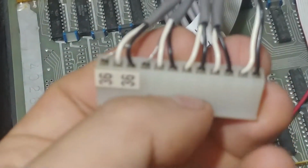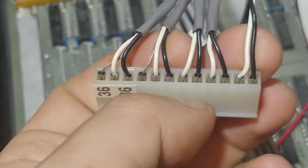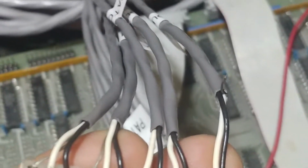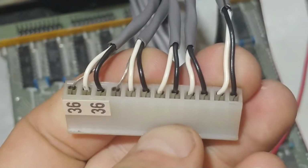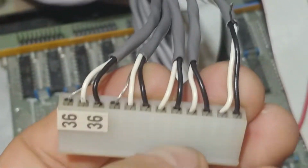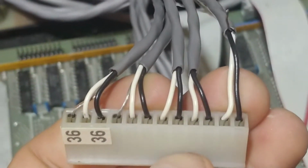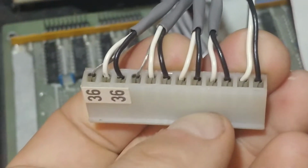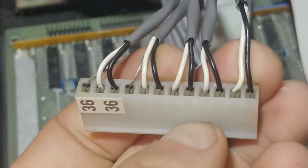Do I try to do it exactly the same way and only use 2 conductors and ignore the third ground up there? Or do I wire them like I am kind of inclined to do and wire all 3 conductor balanced connections to each patch point on the Switchcraft Patchbay?